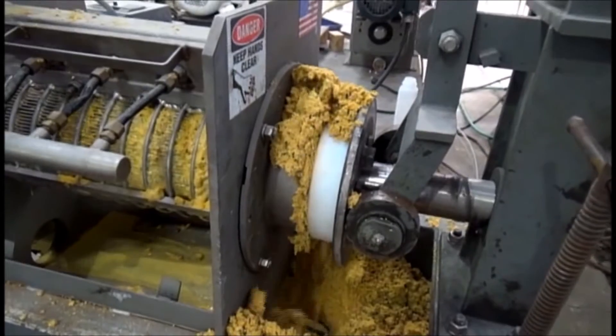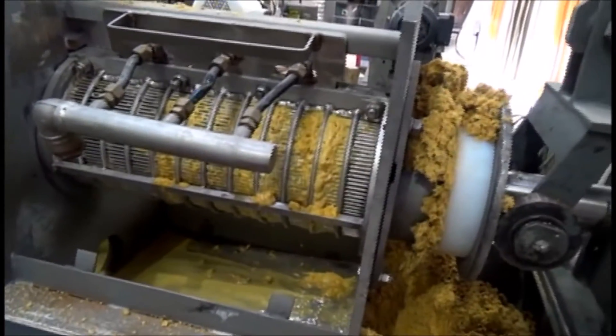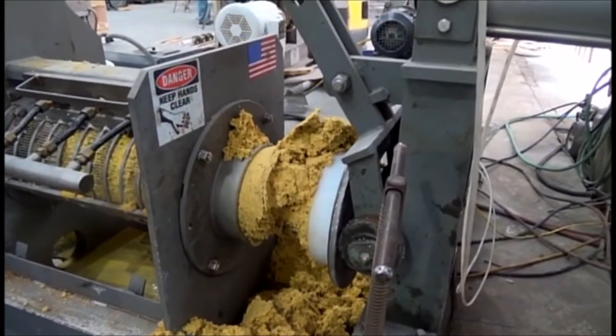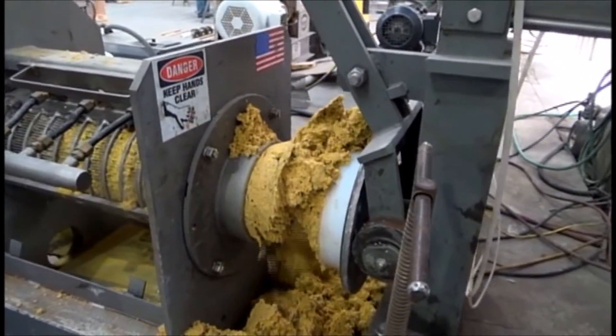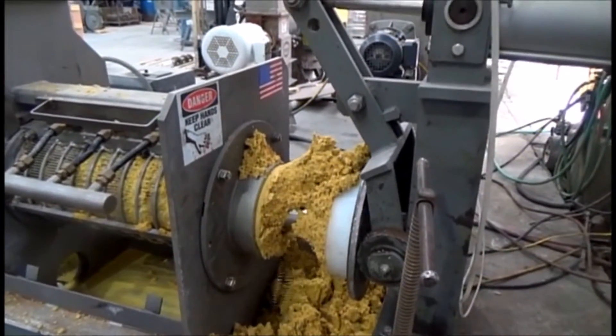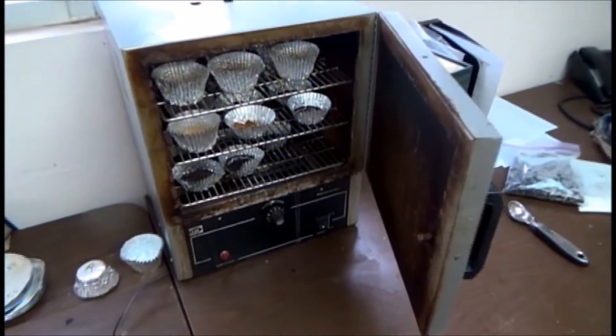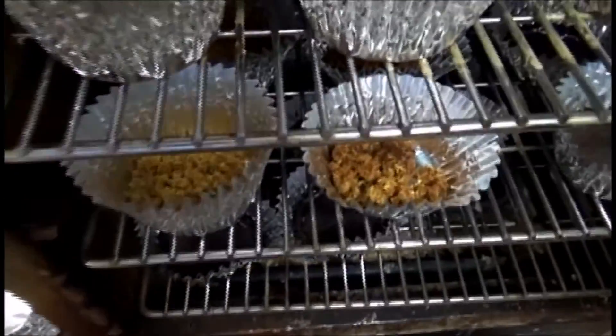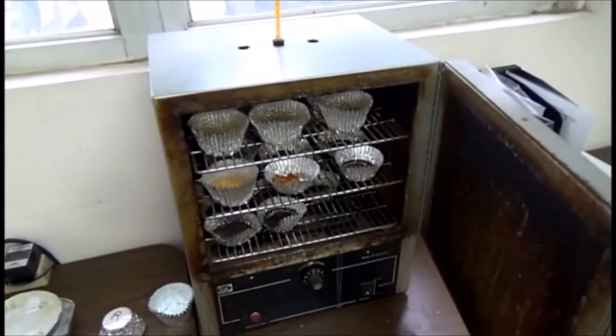Sure enough, I've got the air pressure up to 4 bar, 60 PSI — no luck. We're up to 100 PSI and still no liquid coming out. We took off the air pressure, opened the cone, and are emptying the press. We're running moisture tests, and I can see various samples in there — that would have been press liquor. I'll have the results pretty soon.